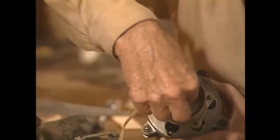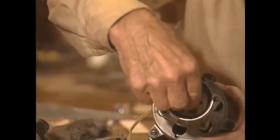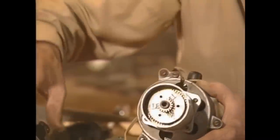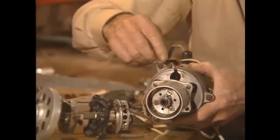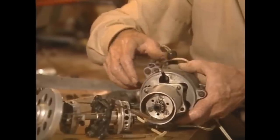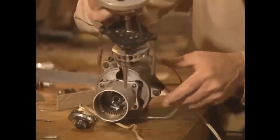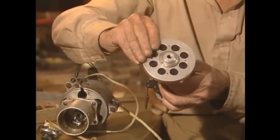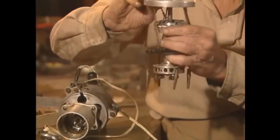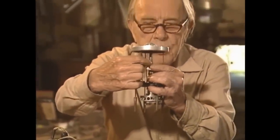This is actually the second stage. There are two stages. If I take this one out, that's the first stage, so that it makes a 10 to 1 reduction — or 13 to 1 in this case — driving the rotor from the high-speed shaft. And coming up through the center of the shaft, a little shaft from the motor itself drives the flywheel separately. That flywheel maintains an artificial horizon and controls the blade, which is in this hub, which I'm now pointing to.